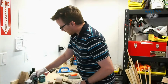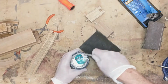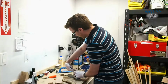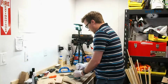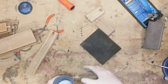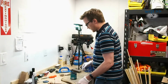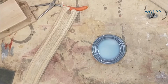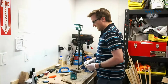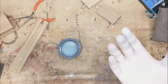Why? I'm going to go ahead and stick with the polyacrylic. So, one interesting thing about these water-based finishes, if you've used them before, is you'll notice that when they are in suspended solution, they're very milky looking. And they kind of foam up a bit as well. So you've got to be careful how thick you apply them, because you don't want a giant chunk of foamy residue left someplace, because then it'll dry and leave a thick clear section that can crack back off again, because it's a fragile plastic, it's acrylic.